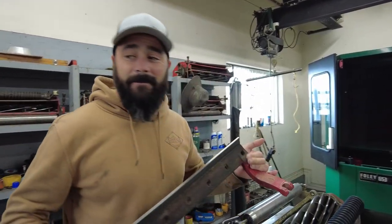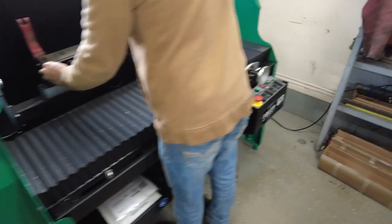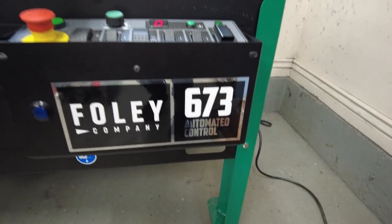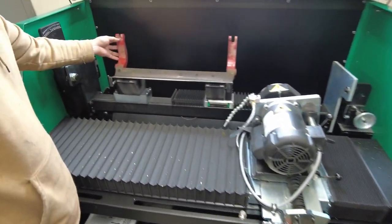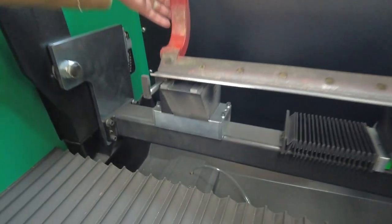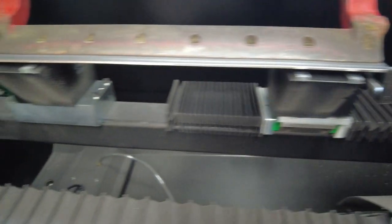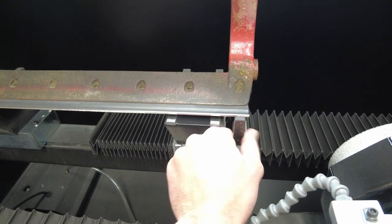Okay, so it comes from the factory with a little grind on it. What we have here is the Foley United 673. This is an automatic bed knife grinder, and the bed knife grinder here features a magnetic mounting system. These are electromagnets, and they have two stops on each side — these are workpiece stops, one here and one here.